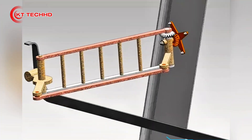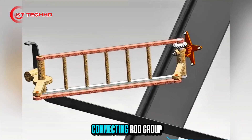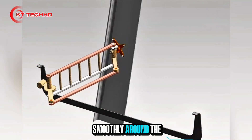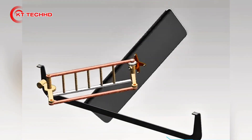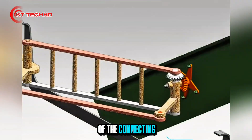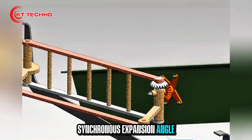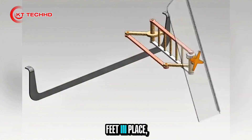Fantastic flip mechanism: a three-gear drive parallelogram connecting rod group stretches synchronously with the shaft. The pedal rotates smoothly around the axis. The parallelogram constraint of the connecting rod keeps it always parallel to the panel. Synchronous expansion angle, reverse lock — three feet lock in place.